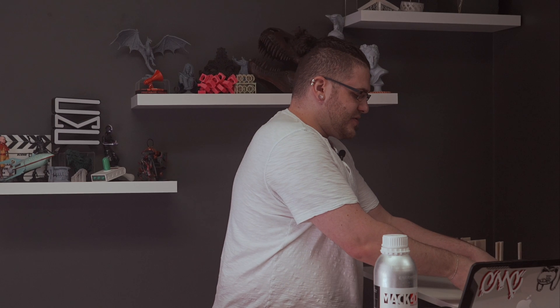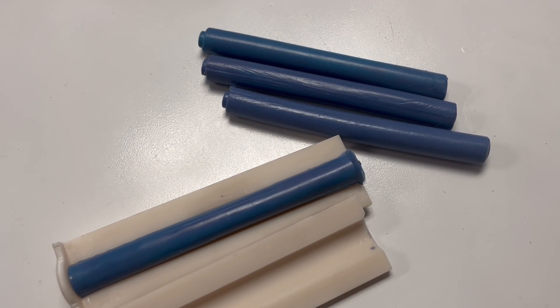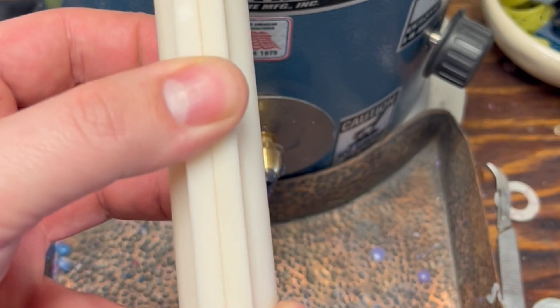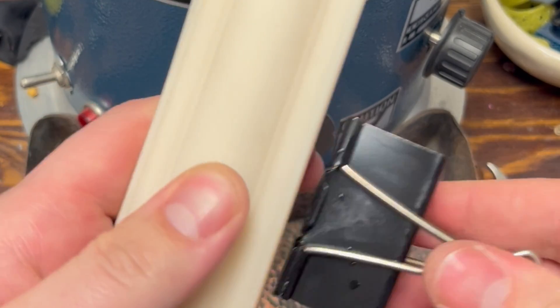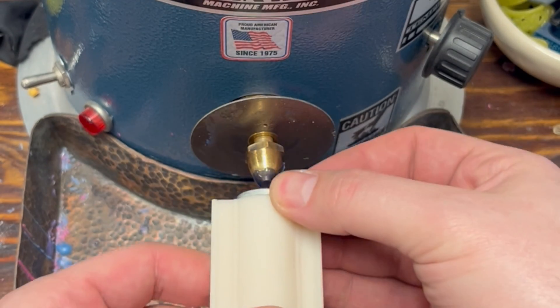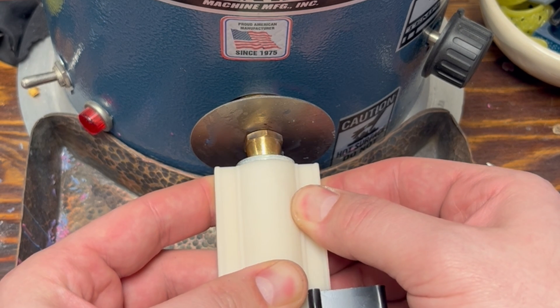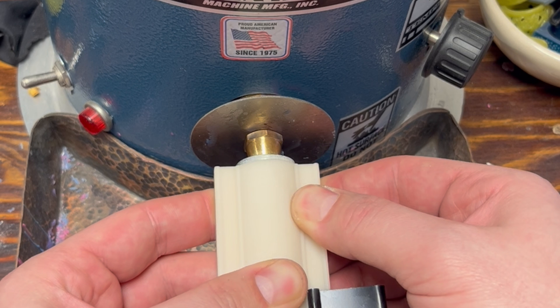So what exactly is this material good for? In the time I've spent printing with it, I came up with these — two-part molds that I designed in CAD for injecting, or even just hot pouring from the top, custom-sized wax sprues. For one of the jobs we were doing, we had to have something very thick and heavy for the center column. I can normally get about three-eighths of an inch or 10 millimeter center column sprues, but I needed to go up to 14 millimeter. These things work excellent.